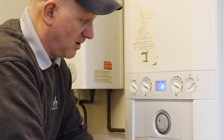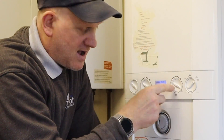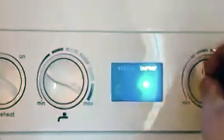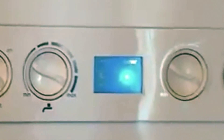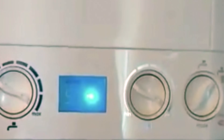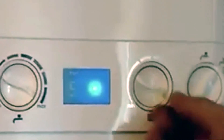With the central heating knob, you have to turn it to the first mark, then quickly twice more. On the screen it will change from C for central heating demand to S for your service demand — that puts you in low fire. If you want to go into high fire, you do one more turn.